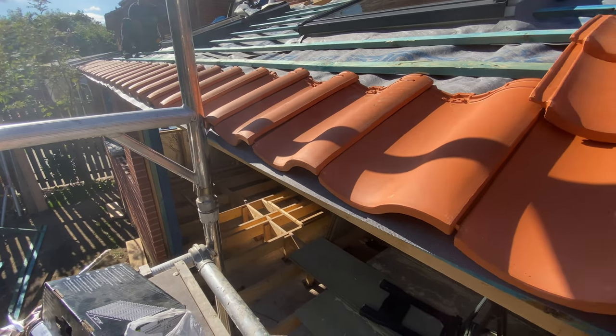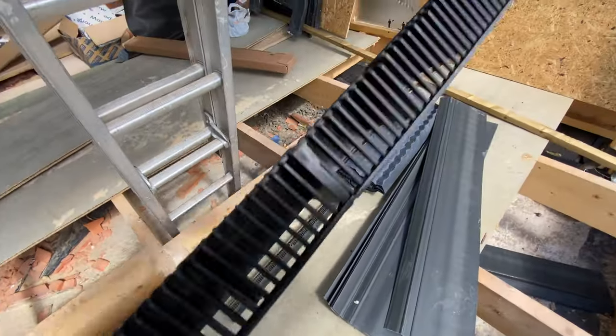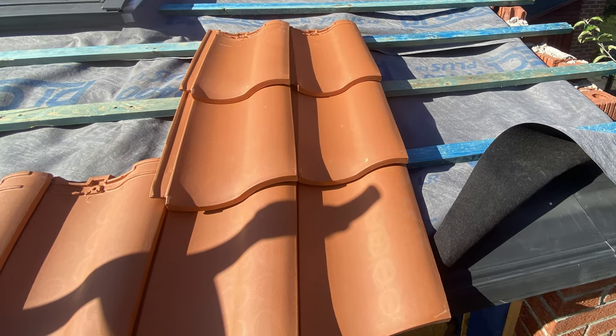I love the developments in construction where it takes the mystery out of the trade and makes it easier and accessible for people like you and me to attempt our own builds. It makes a load of sense — there's not enough labour around in the UK to satisfy the demand of the growing home improvement market. Here I'm using traditional clay pan tiles as an example. There are now a range of accessories that go along with the tiles, which you just mechanically fix in. The tiles also have an interlocking element, though you'd never know it from looking at it, and this allows us non-roofers to do a great job and maintain the manufacturer's guarantee.